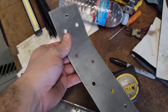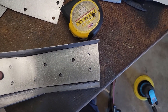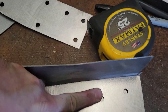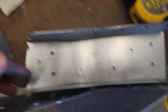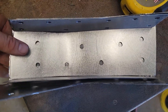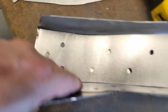Here they are. These are made out of 20-gauge sheet metal and this is made out of 16. These all fit together in here. They're not 100% perfect, but they will be held down and welded. There's a small gap on this side, but it's not really a big deal — I might sand that off a little more. Now, the holes are the same as this side: a series of spot welds. I'm going to take my vice grips, clamp it down, start with the bottom piece, then put the other sides in, do the spot welds, and then weld that whole corner to tie it all together.